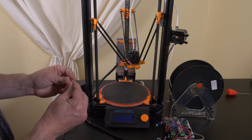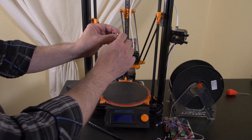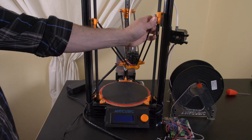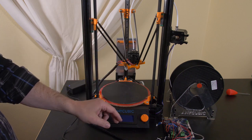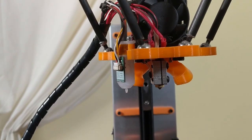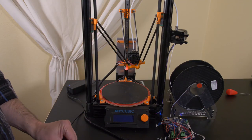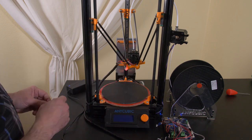And that was slightly problematic because the thicker magnets are much more powerful. And well, powerful is good because it means you don't accidentally pop the magnets out of joint or pop the ball bearings out of joint. But the more powerful magnets were still interfering with the BL touch sensor. And you can see the sensor is functioning perfectly right now because what I've done is I put my remaining weaker, thinner magnets here in the end effector and it works.